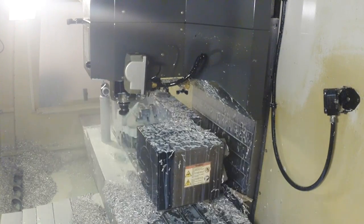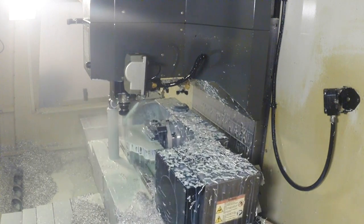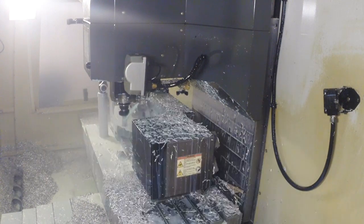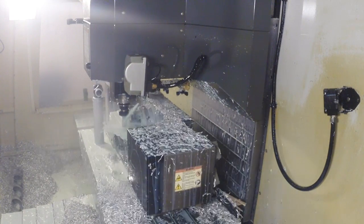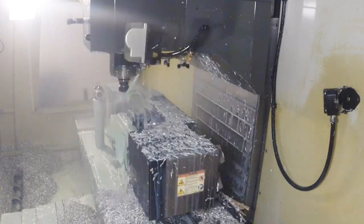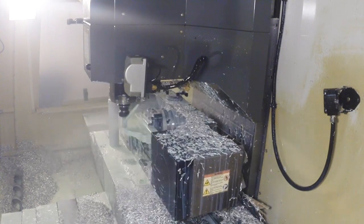For the machinists or gun enthusiasts out there, we're machining 7075 aluminum. We get it from Alcoa or Kaiser, so it's an American-milled product. The Haas VF-3 machine is made in America, so we're using an American-made machine and American-made end mills. The Kyocera end mills we use are made in Japan for the inserted ones — that's the one-inch one you'll see running now.